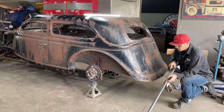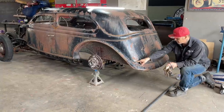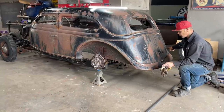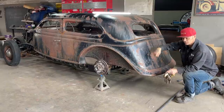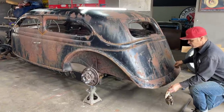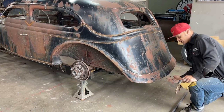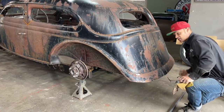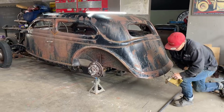That's what I'm going to do at the present moment. I'm going to take a piece of square stock. I'm going to cut it off from that end to that length. I'm going to weld that in there so I know I can lay my floor on it, and I can still get the drill bit or drill down there and rivet that floor on. But then once I get the square stock, I have to make a panel that goes from the square stock down to the body that makes this all tight and closes it off and makes it right.